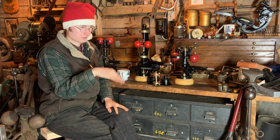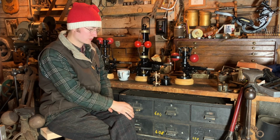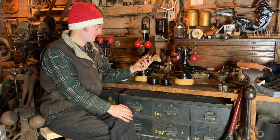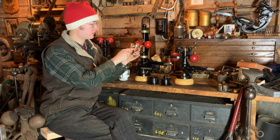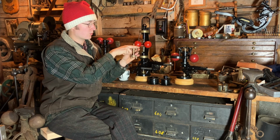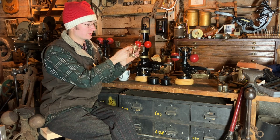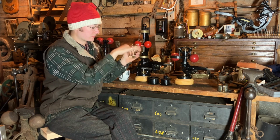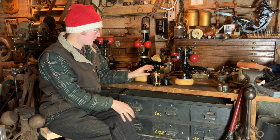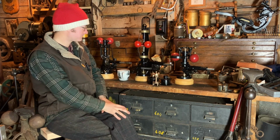So you don't have flickering electrical current, or your loom running fast and slow and the pattern going out of whack. When you're getting close to cutting off, you're still allowing a little bit in. And then equally, when you open it again, you're going to let a little bit in before you let the whole amount flow. So that's how this balanced valve is designed.